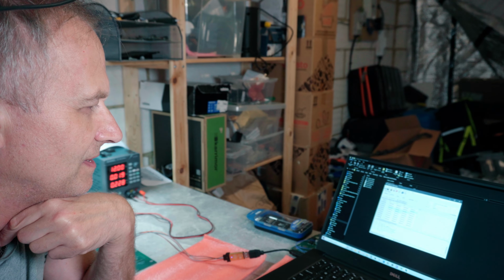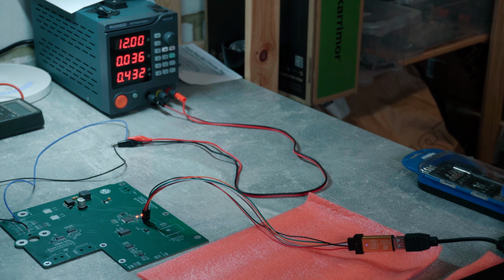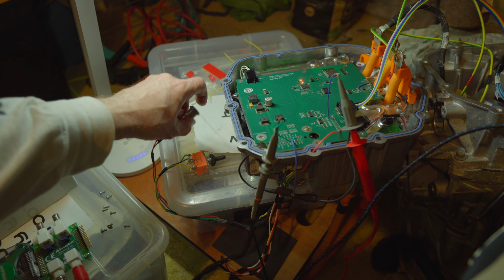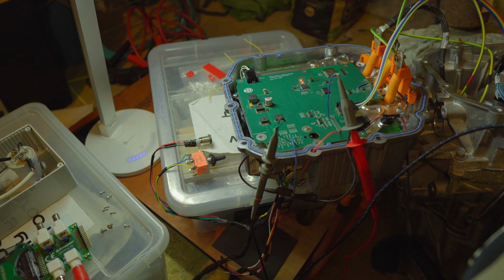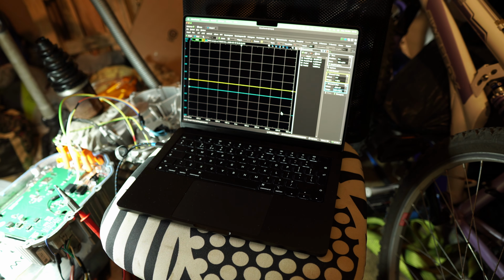At this point I decided to reflash the Open Inverter program onto the STM32 chip. And now what I'm going to do is press start, and now the main contactor is on. And hooray, it worked. Seeing the motor finally respond as expected was an incredible relief. The combination of the Open Inverter board, my custom layout and ESP32 integration was working as planned. Alright, we're getting there. I'm so pleased and so relieved it's working.